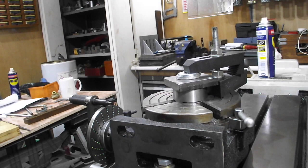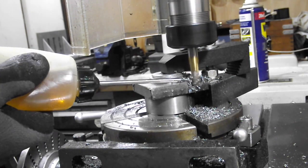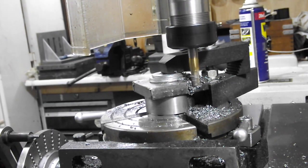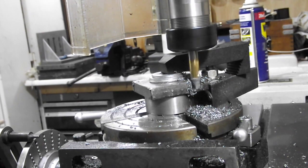Around it is a collar to hold the workpiece as high as possible, hopefully not losing too much rigidity. The base plate is bolted to the rotating table and is butted up to the spine of the workpiece, acting as a driver. The stud holding the base plate is also holding the workpiece down with the aid of a few spacer washers.